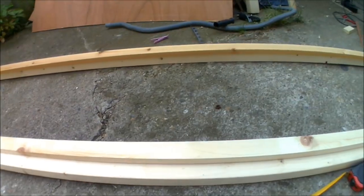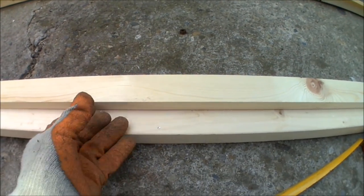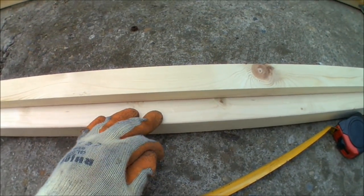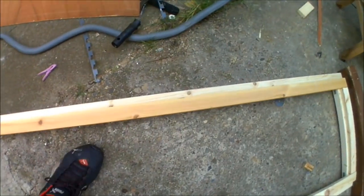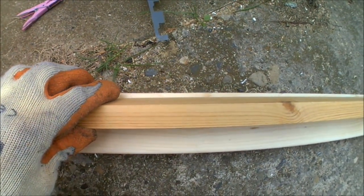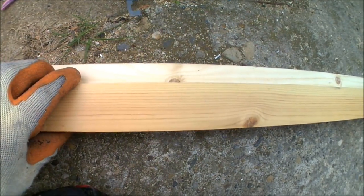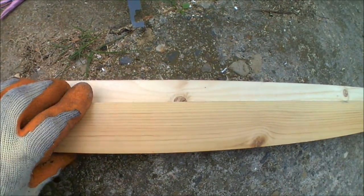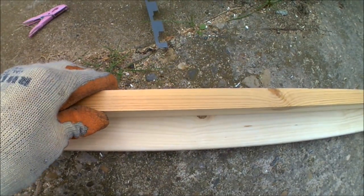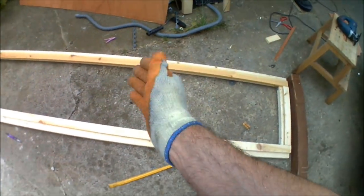The upper frame is starting to come together now. I've left plenty of overlap space because there's going to be another plank sat there that pulls out with additional slats. I've also left a gap on the other side for a hinge going all the way along — you need space to rotate the back up, because if it's right at the back the hinge will just hit the wall straight away. It needs to be a bit further forward, leaving a good inch, so the hinge has plenty of room to open up. Now I'll screw these bits together, attach the ply pieces underneath, and it'll be time for slatting.